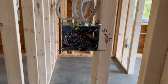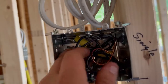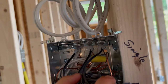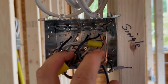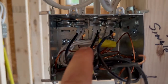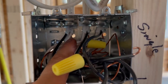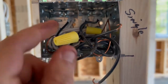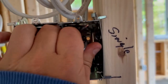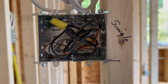You can see the same thing in this two gang box — we have the two boxes together with our wires coming in the top. Everything looks jumbled but it's actually not; we shoved them back quite far during this process because we don't want the zip saw from the drywall tool to nick our wires. You can see all those grounds in the back are twisted together, the whites are all twisted together under the marrette, and we have our tails coming off for each switch. The top of each light goes out to the top — those are some key important features to doing gangable boxes.